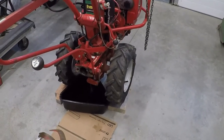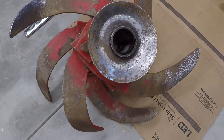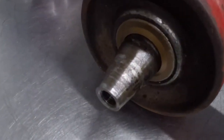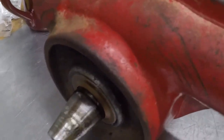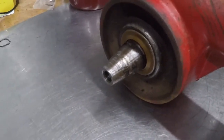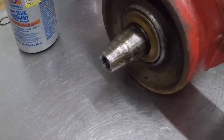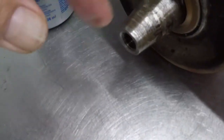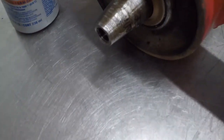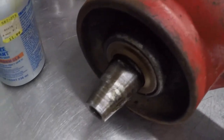When I started to disassemble the tiller, I was having a problem getting the tines off. This particular model has a taper PTO — you can see it's got a matching taper. They don't put any anti-seize lubricant on it; when the connection was made it was just metal to metal. When I'm done, I'm going to put anti-seize lubricant all over the shaft and all over the inside of the taper on the tines so we don't have that problem in the future.